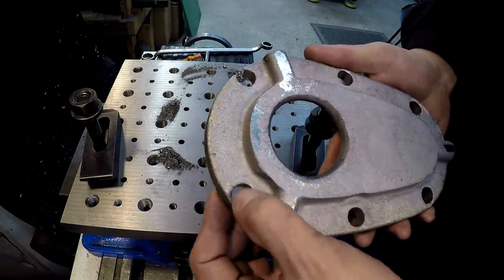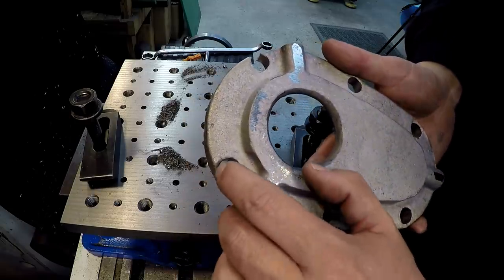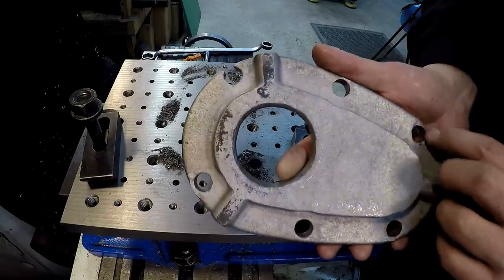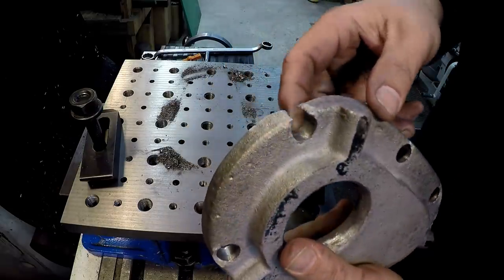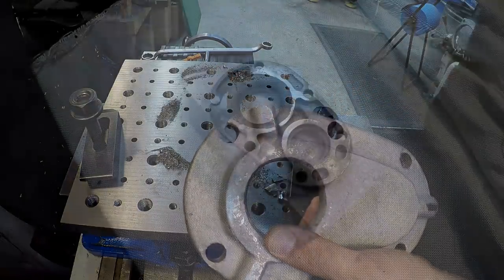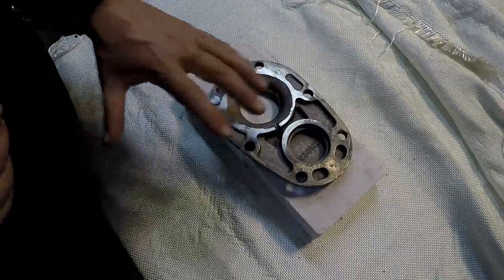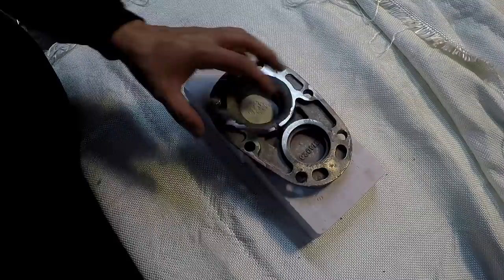I suppose those will work. They're gonna have some washers on the heads of the bolts right there. So you gotta, there's a chip spot there on that one and on this one right here. So that's the one right there that we need to see about adding some metal there. So we're ready to go ahead and start getting this thing preheated, and we're gonna do a braze repair on this. Hopefully we're gonna fill this area up.